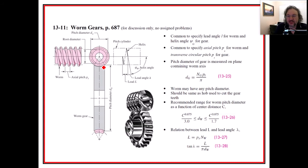Well, let me take that back, because actually my worm gear broke in my snowblower, and apparently that happens a lot. I haven't fixed it yet, so I've been looking for a replacement gear instead of buying the entire assembly. The auger inside the snowblower is like a corkscrew piece that gets turned and draws snow up into the snowblower, where it gets spit out through an impeller. The auger pushes the snow up into the impeller to drive it out. But that's driven by a shaft that's coming straight into this little gearbox, and then out to the side is the axis of the auger itself.